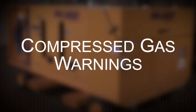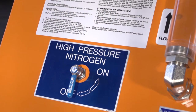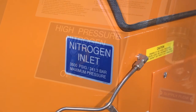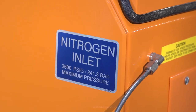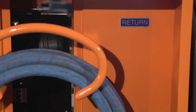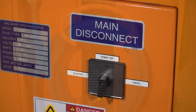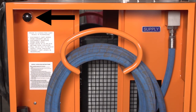Compressed gas warnings: the 1016 cart uses compressed nitrogen gas to purge the aircraft system. Use caution when connecting nitrogen lines to the cart. Sudden release of compressed nitrogen can accelerate particles that may enter eyes or penetrate skin. Always use nitrogen in well-ventilated areas. Pressure hazards: before loosening any tubes, hoses, or fittings, ensure that internal pressure is at zero. Do this by turning off the main power disconnect selector switch and/or the purge valve located by the hose rack.